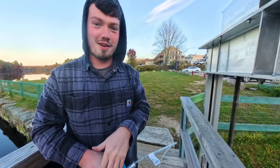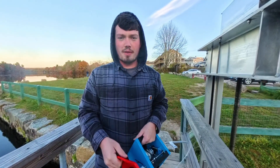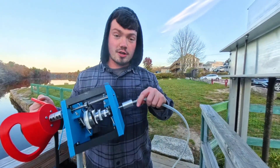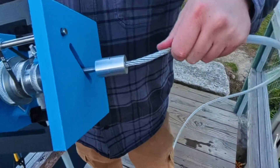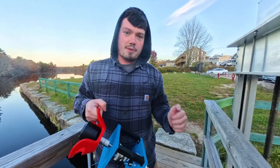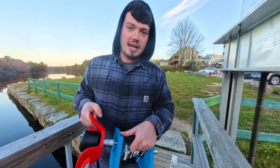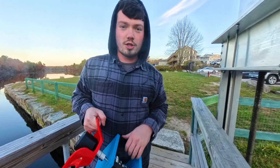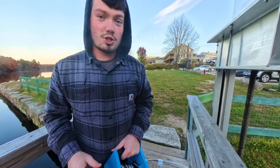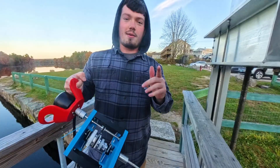We have the second tester, but last time it was showing a much higher value. What's happening is it's taking so much torque to spin this that the cable is actually unwinding itself — you can see it right here, it's untwisting itself and springing. So when I go to do it, it's twisting and stopping. I do think I'm going to try it on the next pulley and see if we can get in there, but there's just going to be too much torque. If we can absolutely shatter that record, that'd be awesome. But I think I'm going to have to reinforce this cable or change to a different material.